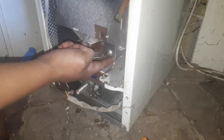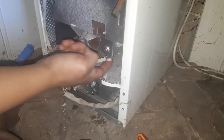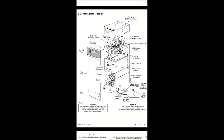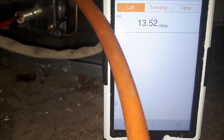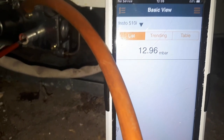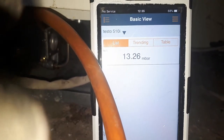A couple of screenshots of the manual — it shows you the gas valve layout and the adjustment screw, which way to turn, and also the specifications. You've got all your burner outputs, all the other readings, and the different models. The burner pressure we're after here is 13 millibar. So we're on the burner test point and I want to get as close to 13 as possible.